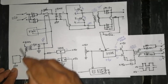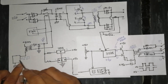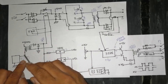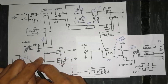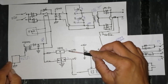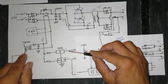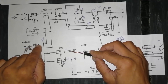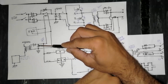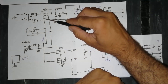The IC switches at a specific frequency — about 60 kHz to 120 kHz, depending on the design. Every inverter welding machine may have a different design; even from the same manufacturer you may find different ICs. When it starts switching, we find a voltage output of approximately 25 volts in the output capacitor.